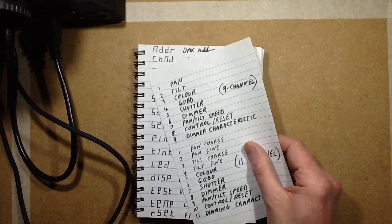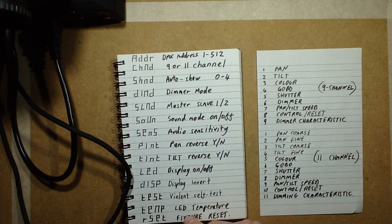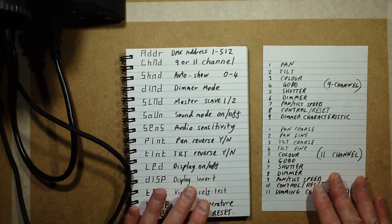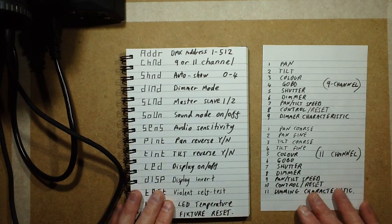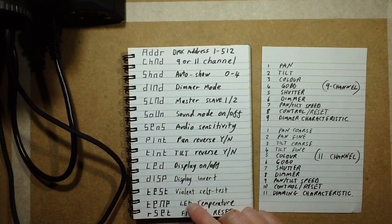Now, things worthy of note. The power of it draws 40 watts. It says in the manual it draws 25 watts, but it actually draws 40. So let's bring these in. The LED it says is 10 watt. I checked it out, and when the LED is on and off, the difference in power consumption of the fixture is 8 watts. So let's say an 8 watt fixture. The LED heatsink runs about 40 degrees centigrade above ambient, which is quite good.